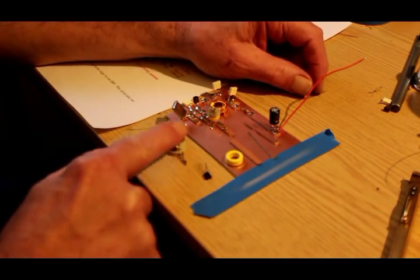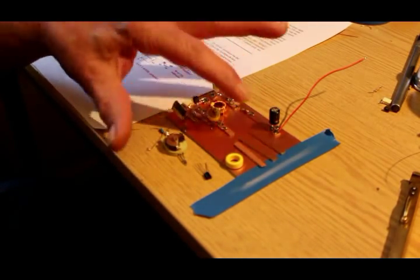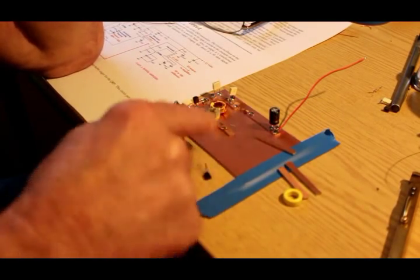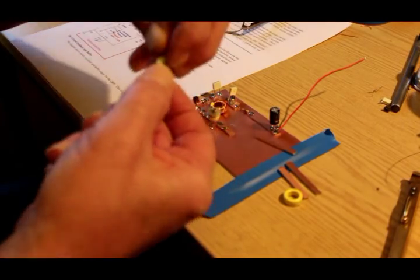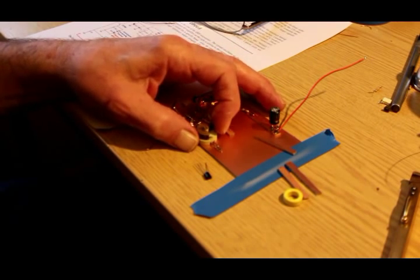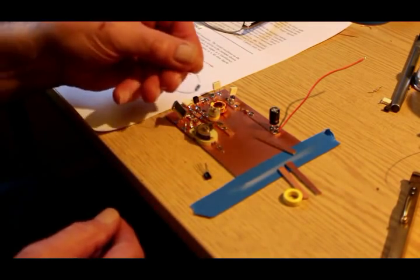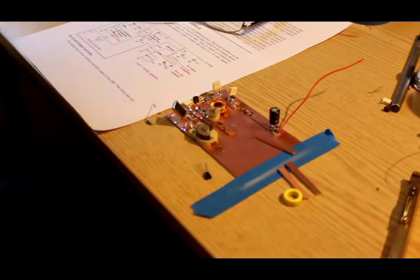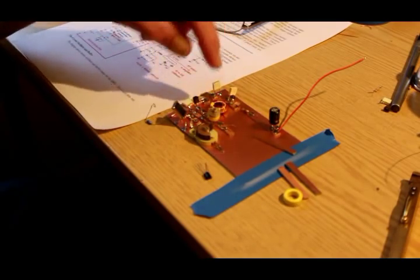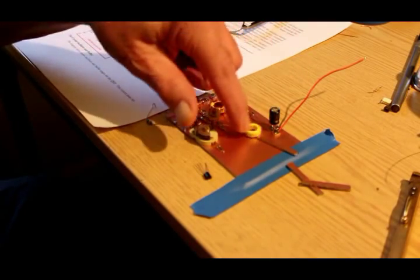At the moment we're just working out where things go on the PCB. We've got some more strips of PCB to lay out. There appears to be a tremendous amount of room here, but this rather nice ceramic preset trimmer — an air-spaced one — has got to go there to give us some variation on the crystal frequency, as has this little choke. We can't really use much space down here, so we'll go more that way, and above all there's another transformer that has to go in there.